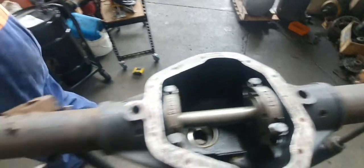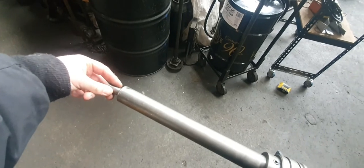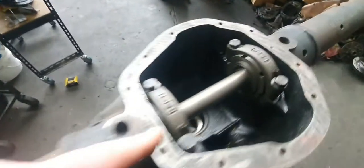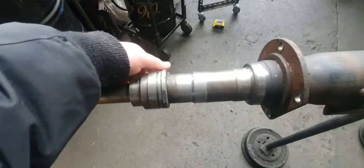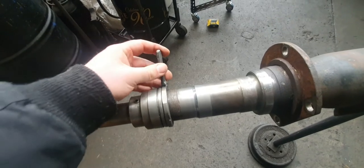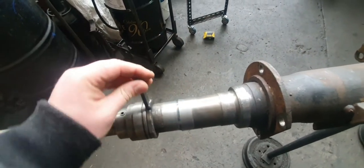So I go and get my big trusty drill. Put the drill on the end. Clamp the drill on the end. Drill rotates the bar, which rotates the cutting tip. And to feed it in, to cut more or less, you just turn this nut on the end. Screw it in and this all will go forward. Screw it out, this all will come back.